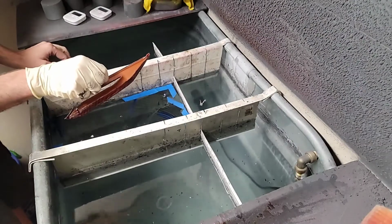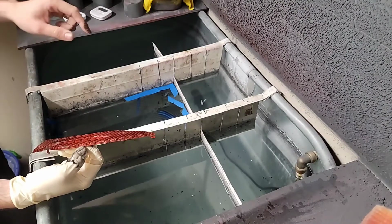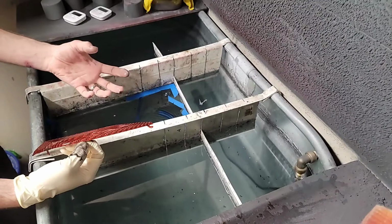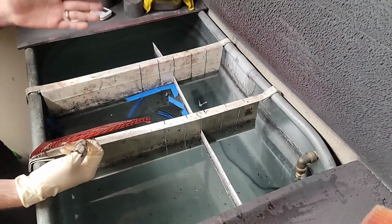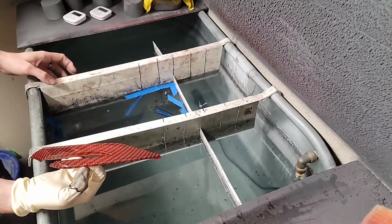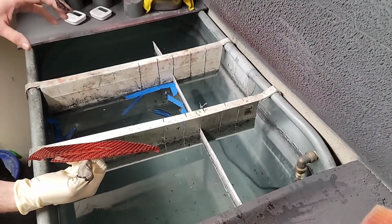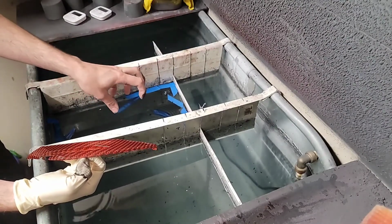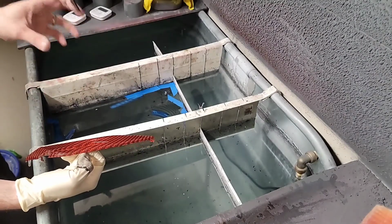Remember, you don't want to go straight in because of entrapped air. That's something I think a lot of guys talk about, but I'll cover it. If you go straight down, you can get air in there that'll mess with stuff. If you go in at an angle, the air will be forced out from the sides and it'll work better. That's one of the biggest things, especially with odd shaped sizes. If you create an air pocket, the dip cannot stick because the air is stuck in there. So keep that in mind when you're dipping and the angles you choose to go in.